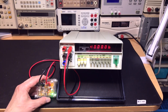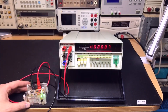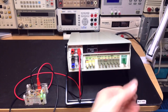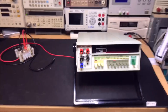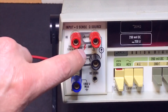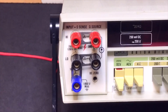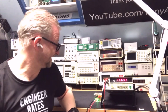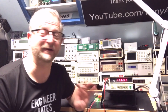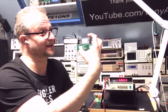Look at this: 10.0000 — exactly what it should be. Perfect. I also managed to clean the binding posts — if I zoom in here, they are very shiny now. I just did that with the brass cleaner and you just get back the shine. So that's it — the Fluke 8810A. It only needed some cleaning. All the adjustments were already fine so I didn't touch them. Now I feel a lot better having it in my stack, because it was sticking out as the one dirty machine. Happy with the result.